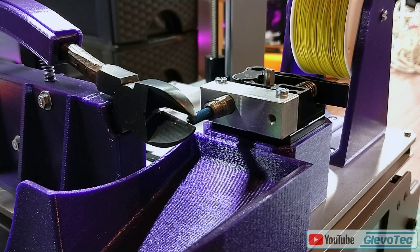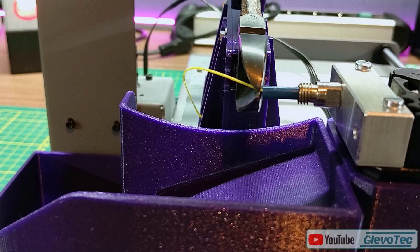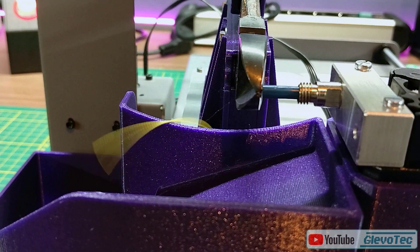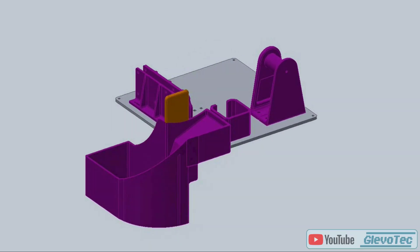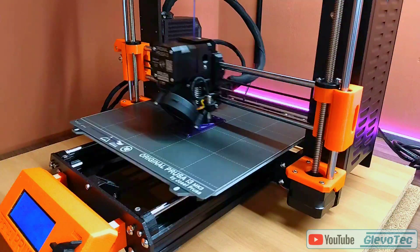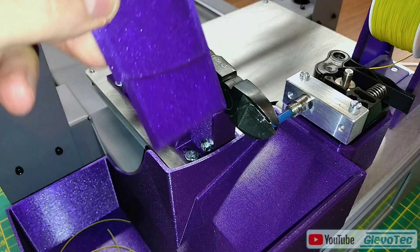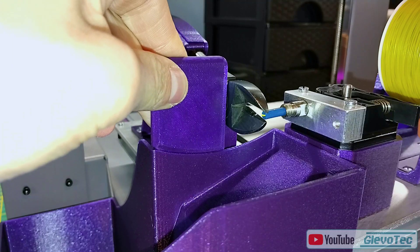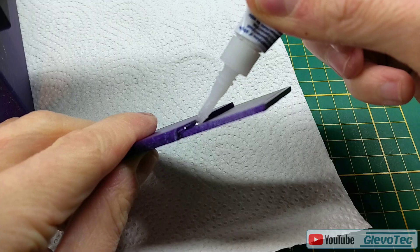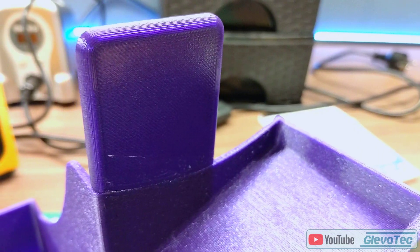The sequence is fine as well as the cutting operation itself. The only issue is that the wire tends to curl and end up outside of the catch tray. So I solved this by designing an extra piece that will keep the wire from escaping. A quick print on my printer, and there it is — some super glue to bond it to the catch container, and it's time to try again.